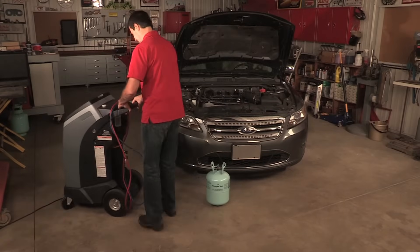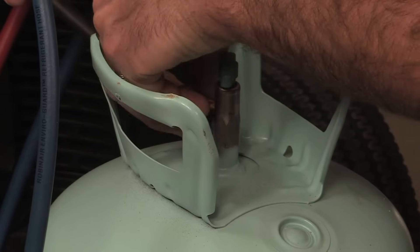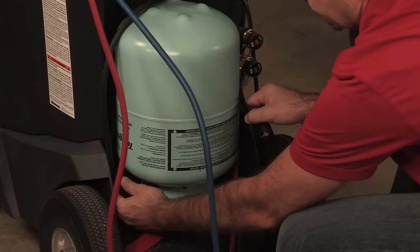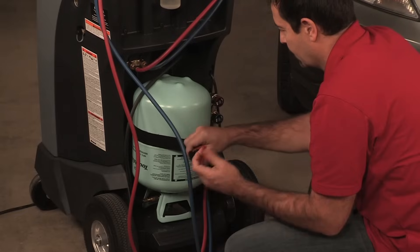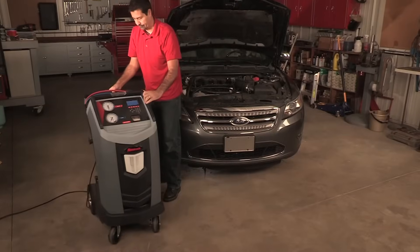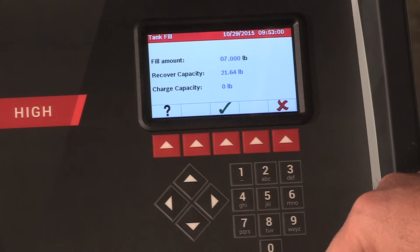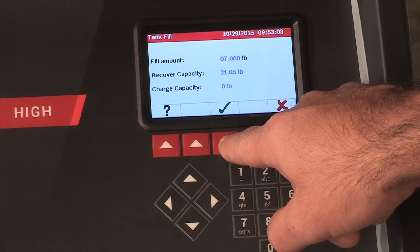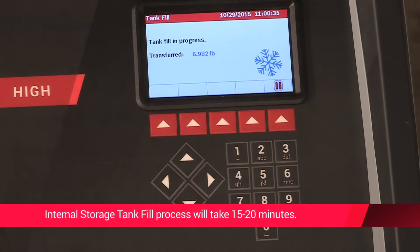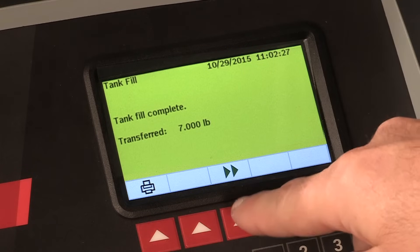After the tank clearing process is done, you will need to fill the internal tank. Connect the tank fill hose to the source tank fitting and open the tank valve. In order to fill the internal storage vessel, or ISV, position the source tank on the rear of the machine so the liquid refrigerant is supplied to the connection. Use the strap shown here to secure the tank in place. Be careful not to block the vents on the lower right side. Adjust the ISV's fill rate to at least 3.6 kilograms or 8 pounds by using the keypad. After setting the amount, press the hot key to make your selection. This process takes about 15 to 20 minutes. The machine stops when the designated amount of refrigerant has been transferred to the ISV or when the source tank is empty. Press the hot key to return to the functions menu.